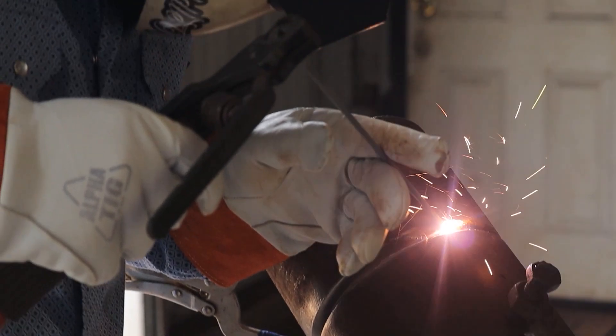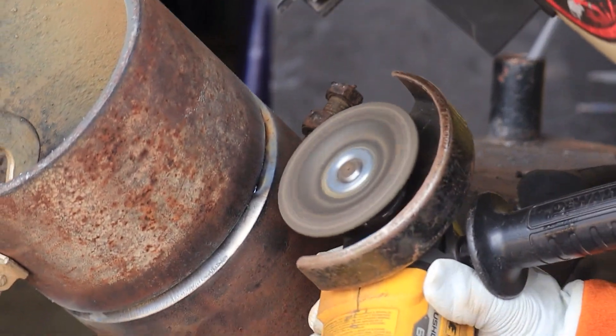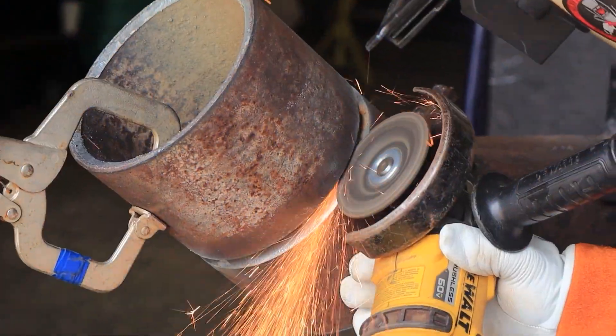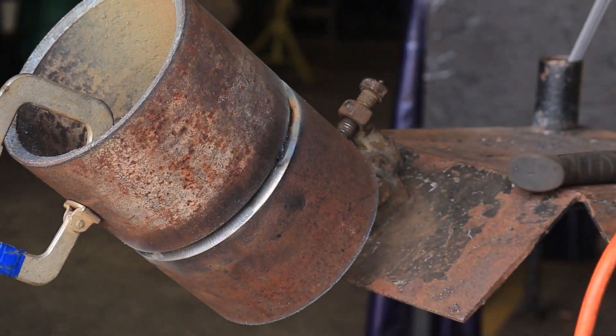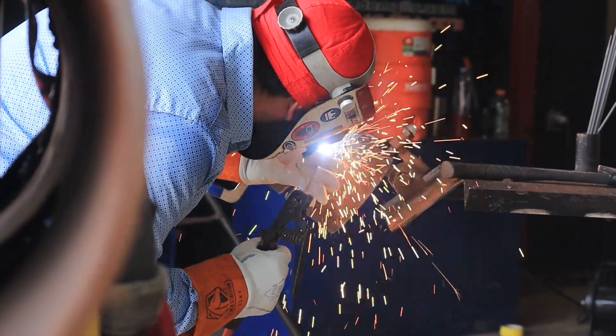Right here I'm going to start before my keyhole. I'm going to get that rod hot, tie into it, and just drag the rod. Sometimes the bead disconnects so you've got to push it back in, but make sure that rod is always inside. Further down your tie-ins, then just keep going. Always start an inch before your tie-in so you get a good tie-in through the inside.